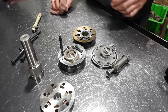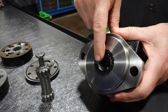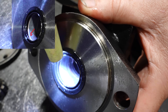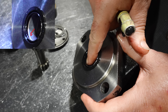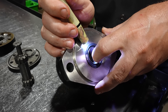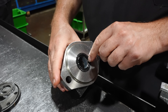It looks like it's a new motor. There's nothing on the thrust bearing showing any contamination. I don't see any scratches here or here. There are no shiny spots or anything on this. I don't feel anything on the inner seal. Looks like there's a piece of something in there. If they had some kind of crap go through... I felt something there.